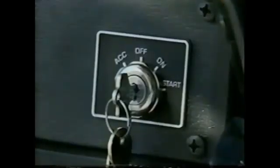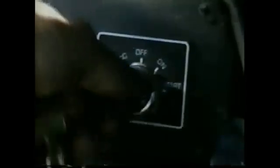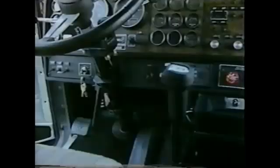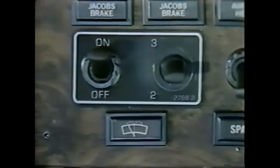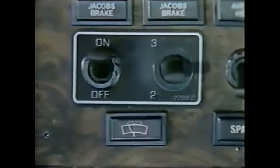You'll be glad to know that operating with an engine retarder actually makes driving easier. The Jake Brake uses engine oil for hydraulic fluid, so be sure to let the engine warm up before proceeding. The dash switch turns the system on and off. Normally, it is left in the on position whenever you're driving.